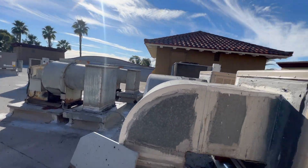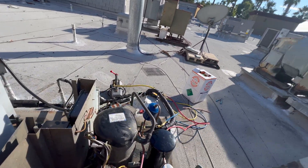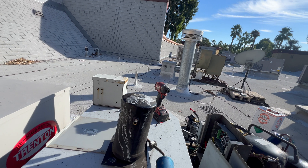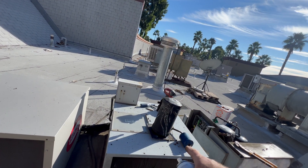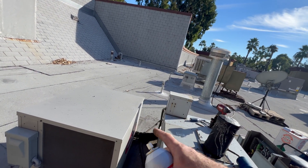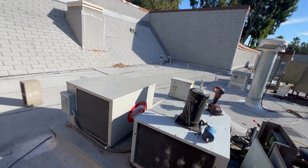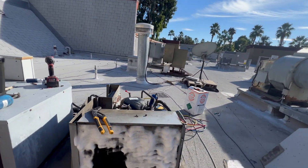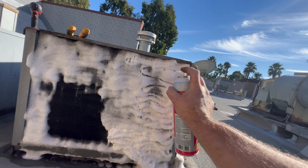Overall, this restaurant got two new swamp coolers. We did lots of work here: low pressure switch, timer, filter dryer, receiver, two bimetal switches downstairs. This one didn't have any issues, but the previous company had the systems reversed — they thought this was the island coolers and this was the walk-in, but it's reversed. They put a new evaporator coil into the walk-in cooler but swapped the wrong condenser. I don't know how they worked on a system not knowing which condenser is what.